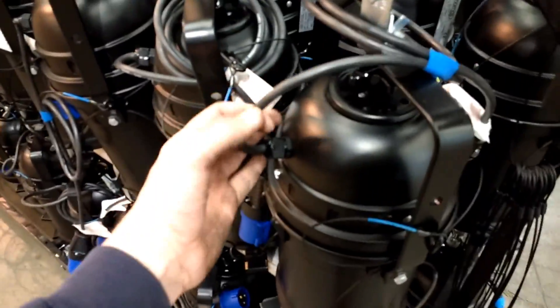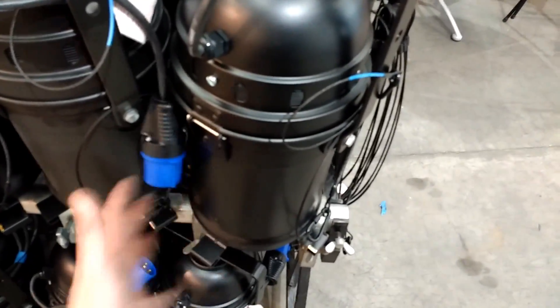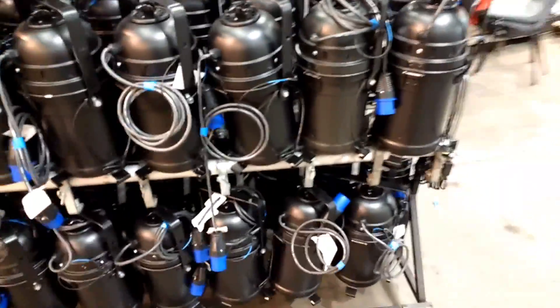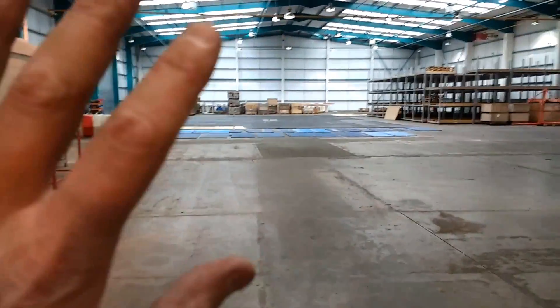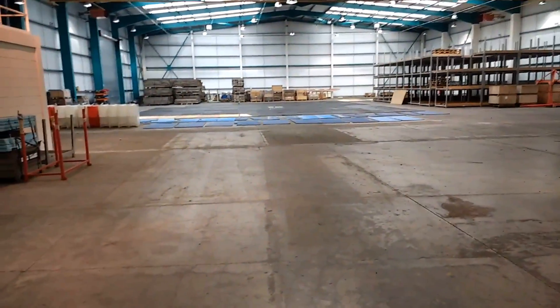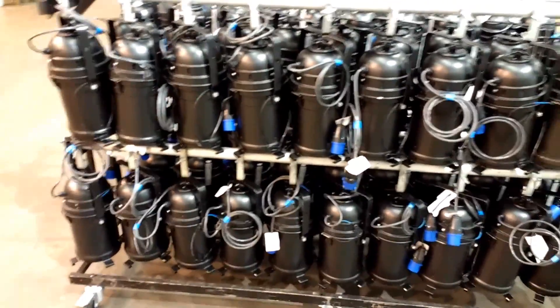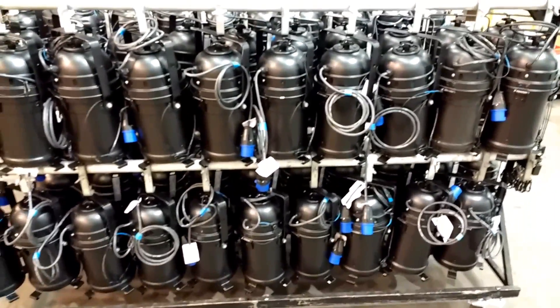The main characteristics are being heat-resistant. The long barrel in the front is just to avoid beam spread — you do get short PAR-cans designed for that, but these ones are engineered to fire the beam out in a straight line. If we're pointing over there, you'd get quite a modest beam fired and it would go quite a distance. These are rated about a kilowatt each, which adds up to quite a lot — some very busy dimmers down below running these. But that's PAR-cans.